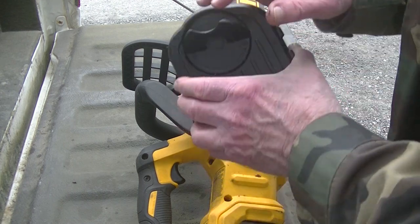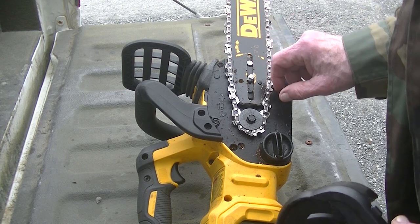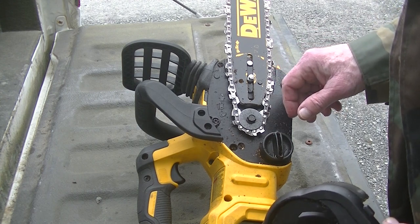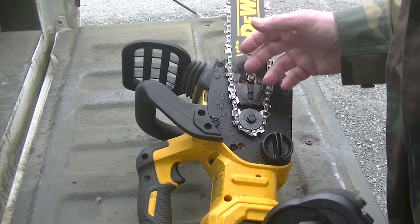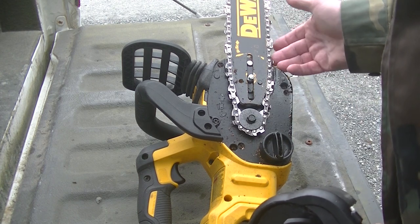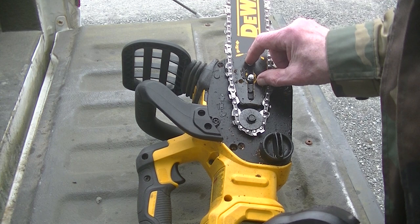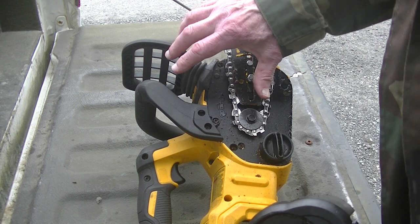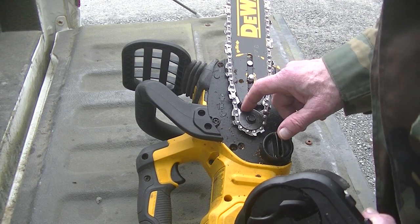This is the one that fits in here to tighten it down. What happened — if you watched my last video — I was working down on the ground in the moss, sucking a bunch of stuff in here that normally wouldn't get sucked in if you're just doing regular cutting. I sucked in so much stuff that it actually pushed the bar off these pins here. That allowed the bar to rotate far enough up so the chain wedged itself in the drive sprocket and everything went clunk.